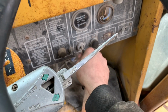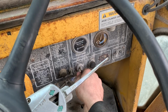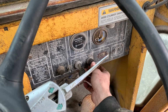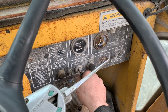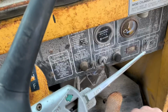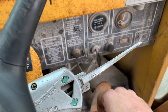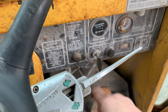Again? That wasn't me, the solenoid stuck. I said the solenoid had stuck. Yep. I have a feeling that solenoid sticking is what ate the teeth off the flywheel, because the starter's trying to stay engaged while it's running, and it's just eating teeth off.